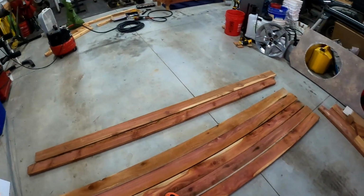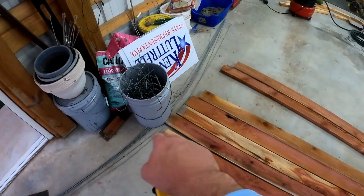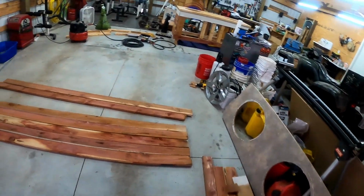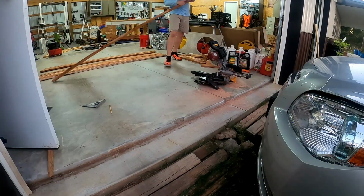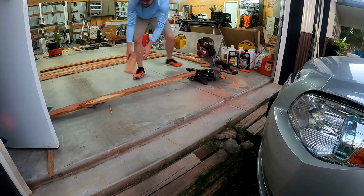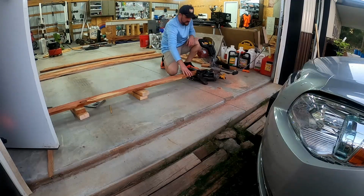But in the meantime, we're gonna cut them at right about 58 inches and get all the junk. We're gonna square up the ends, cut them at 58 inches, and avoid bows like that. When you're dealing with this rough cut lumber, sometimes you gotta get a little creative and do a little more thinking than with some other stuff. But gosh, does it look good and does it pay off? Just squaring up the ends to start.